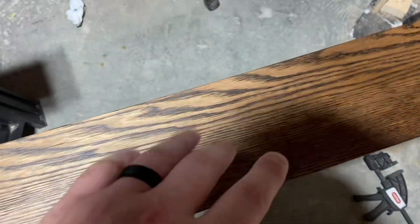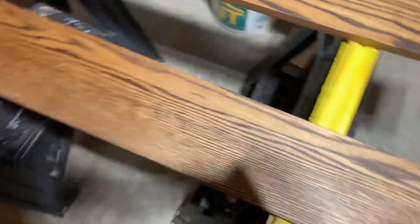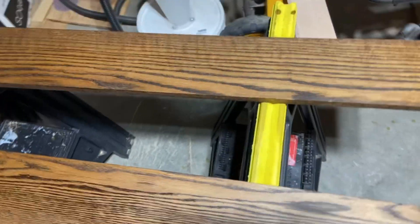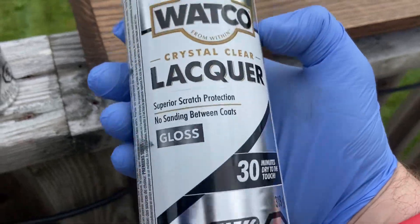Just did another coat — it's still fresh so we'll check it after it's done. After a quick light sand, I did a really light pass with some stain, just buffed it in without too much soak, and immediately wiped it off again just to even it out. It's looking pretty good. I actually like the grain of oak — that's why we chose it, plus it's a little cheaper than maple. Looks great. I'll let that dry and then put on some lacquer.